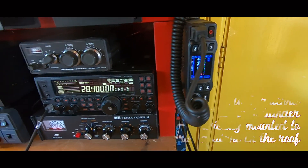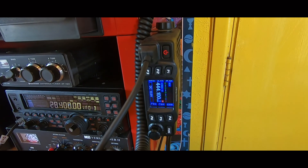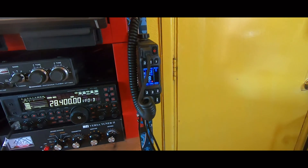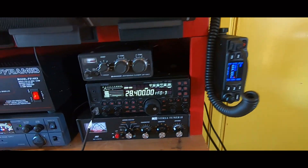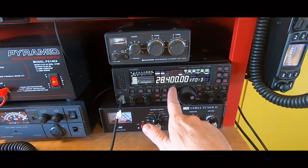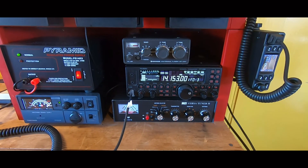This is a plain-jane dual-band FM UHF/VHF radio — two meters and 70 centimeters, FM only. No sideband, no digital — it doesn't do any of that. It works fine at 25 watts; I generally keep it on 25 watts, dropping to around 10–15 watts when talking close by, with a minimum of 5 watts. The HF radio consistently swings about 105 watts. I run it on 10 meters, 15 meters, 20 meters, and 40 meters. Let's go to 20 meters and see if it's active right now.